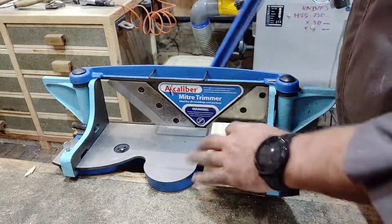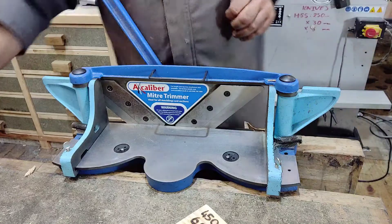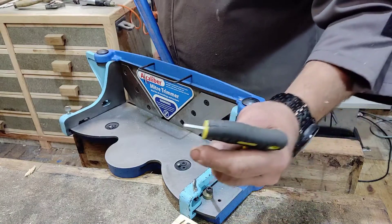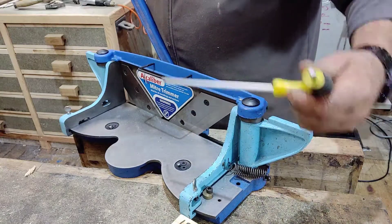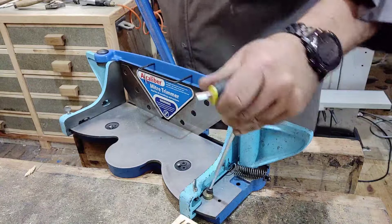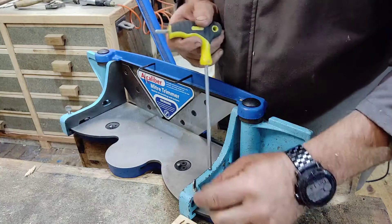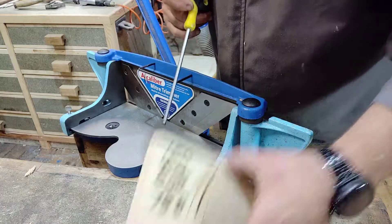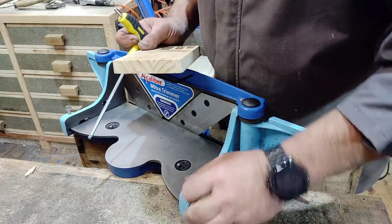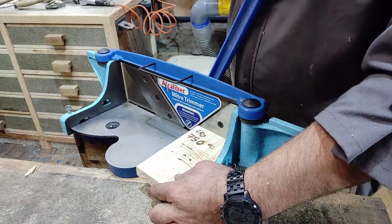But let's say it wasn't — I've just adjusted it. All you have to do to adjust it is loosen this Allen bolt here. It's a five mil, I think. And then there's a cam around it — this little brass thing here is a cam, and it turns around, so effectively it's a rest. You can rest it against it. All you have to do is set this at 90 degrees using this technique — making cuts, alternating both ways, and then moving the fence gently in either direction and setting it at 90 each time.